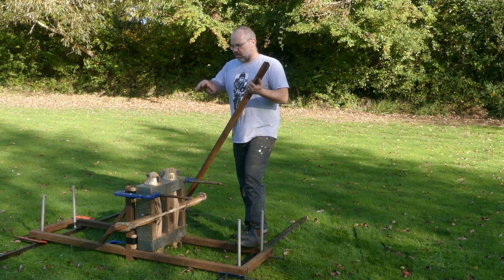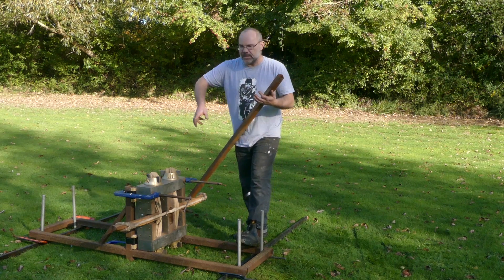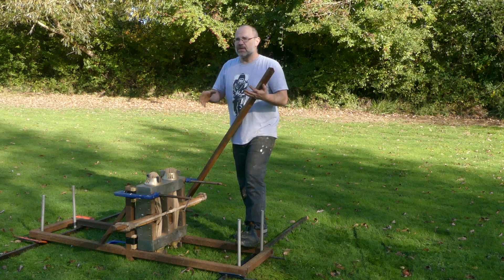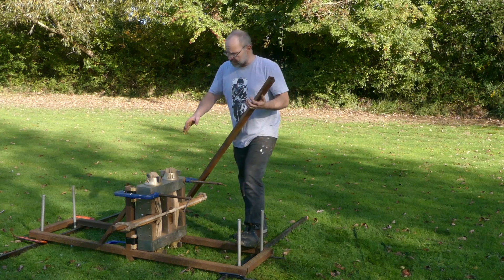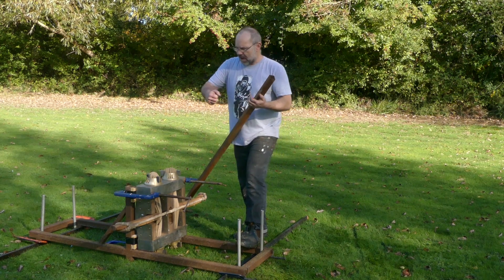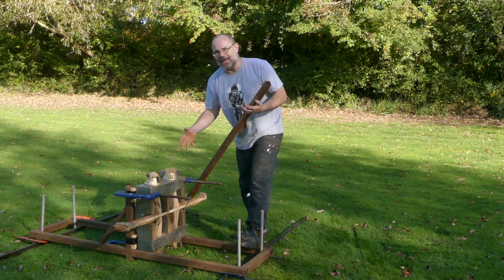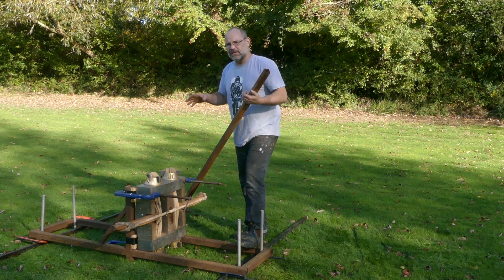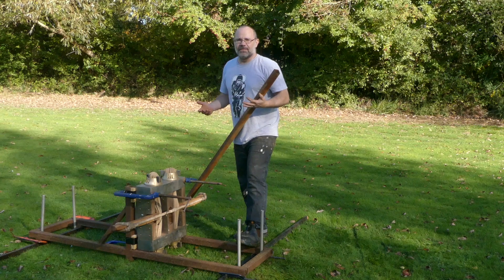It's really important that these bundles are tight. If you just put twist after twist, when you pull the arms back the outsides of the bundles — some of the ropes — are doing work, but the insides are not really under much tension at all. You get a very lazy machine. To get an efficient machine — and the Romans were fabulous at this — you pre-tension. You absolutely pull them tight until a Roman legionary can pluck it and hear a particular note. He clamps it and winds on to the next one, pulling tight until he gets that note again. That tightness is absolutely critical. We don't know how they did it, so I had to invent a device for doing it.